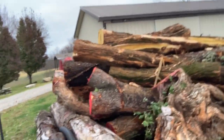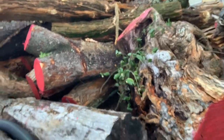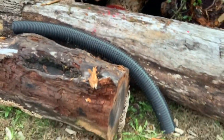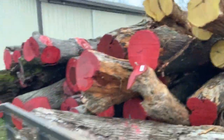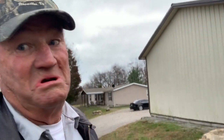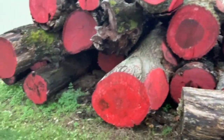Look at this big gnarly stump — we'll chainsaw it and maneuver it around to see if we can get it on the sawmill. That ought to make some wild-looking stuff. There's a crotch cherry log. These two logs here are ash; they're going to go to firewood. I use anchor seal, and when I bought this five-gallon bucket, all they had was red. Don't do that — it works fine, but it gets all over you, sprinkles on your face, gets on your clothes and your truck. Go with clear or white, but anchor seal is what everybody told me to use.